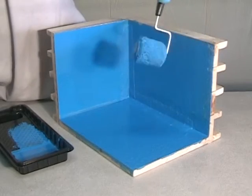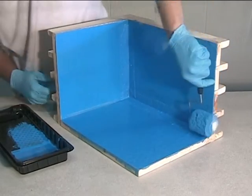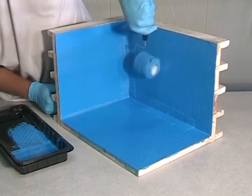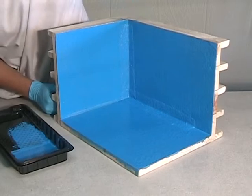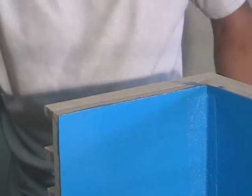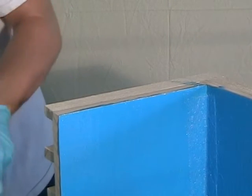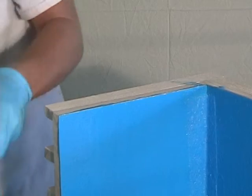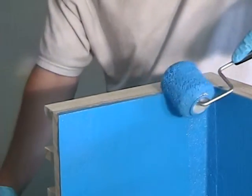When applying subsequent coats, you only need to allow previous coats to tack up. A good test involves touching the coating. If it is sticky but not coming off on your finger or coming off of the surface, an additional coat can be applied at that time. This is only true for each coat after the first coat. The first coat should always be allowed to cure 24 hours before sanding and continuing with the process.